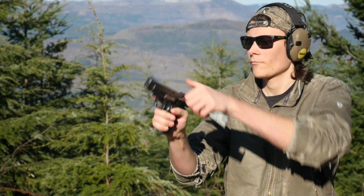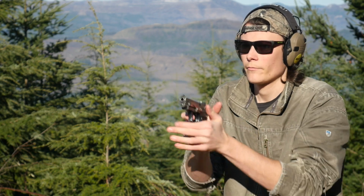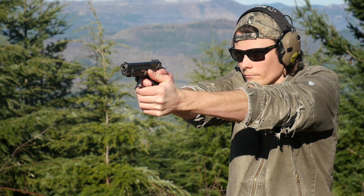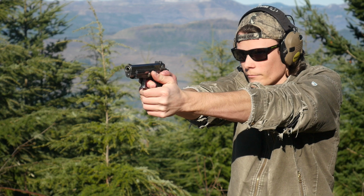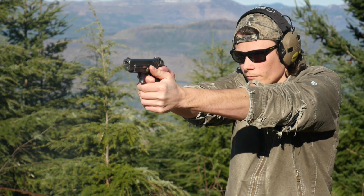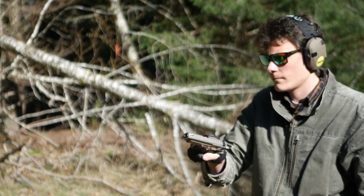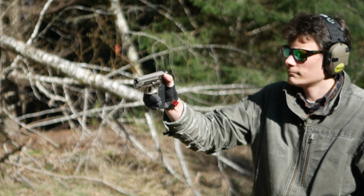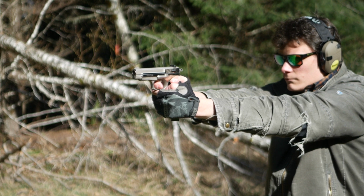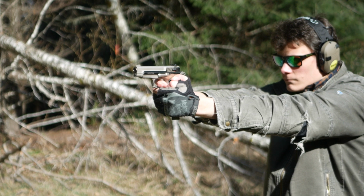I could probably recondition it with a new extractor and recoil spring, and a fresh magazine wouldn't hurt either, but parts for these aren't exactly common, and they tend to come from other exhausted pistols just like this one. Remember that Star went out of business before, statistically speaking, almost all of my audience was born. Reliability of the 31P out of the box wasn't good, but I gave it a more thorough cleaning and oiling, and after a few mags it started to work perfectly. In my experience, Star pistols are exceptionally reliable and well made, as long as you don't leave them alone with the Israelis for 3 decades.